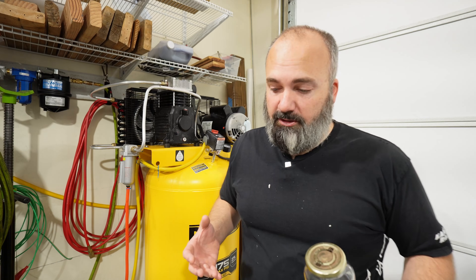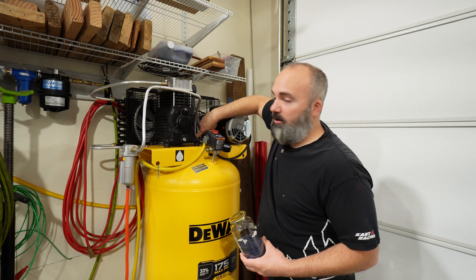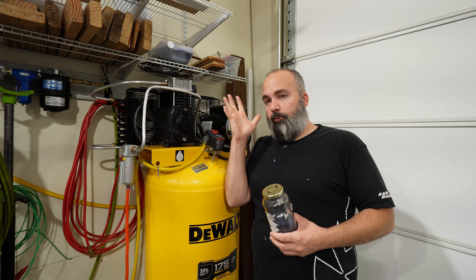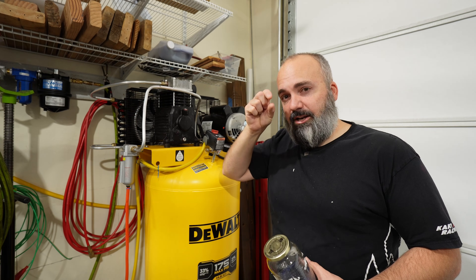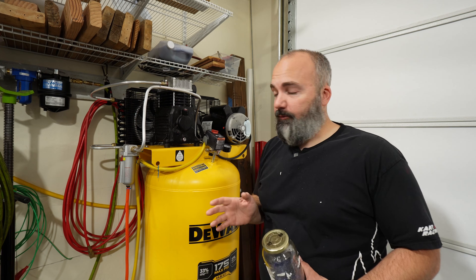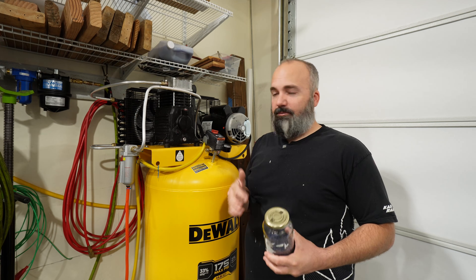Real-world update: it works. Is it perfect? No. But in our very warm, humid environment because of my swamp cooler, it's working fantastic. I did have one failure — remember it was leaking up here at the one-way check valve into the tank. That line started leaking worse and worse. I tightened it and it blew itself right off. I must have crimped the aluminum. When I pulled the fitting off, I could see the ferrule was a little bit sideways — I think it was cutting into the aluminum, and the vibration allowed it to break. I cut it, re-bent it a little bit, put a new ferrule on there, and so far it's been good and leak-free. Learning lesson: I probably should have just gone the extra expense and bought the copper. It would have been stronger, but lesson learned. I have another six to eight feet of this, so if anything breaks I'll just bend a new line. Thanks for watching — I really appreciate you. I'll see you in the next one.